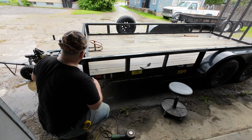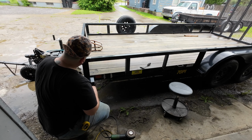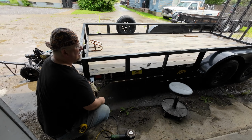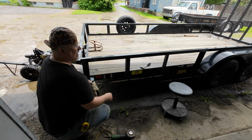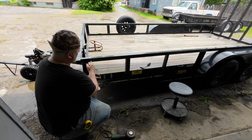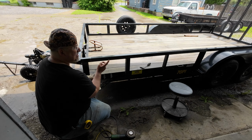And then I'll take a piece of angle or something and clamp it here to hold. Same thing on that end. That'll also help me with the alignment once I put it back together. Because once I get it out, I'm probably going to cut off an extra 1/8 inch on either side, so we have just a little extra clearance. I've got to make the hinges yet, and then we'll have some pins up on top here. It'll probably just be a little piece of angle to hold so you can pop a pin through it.